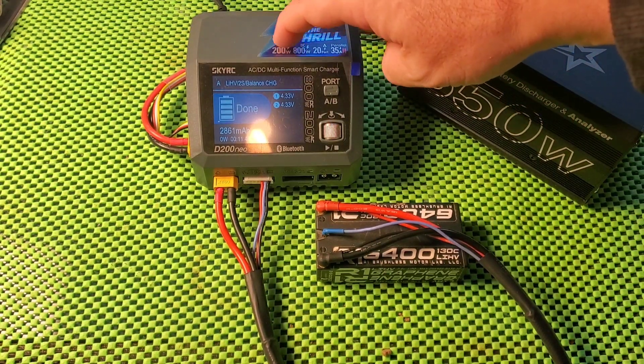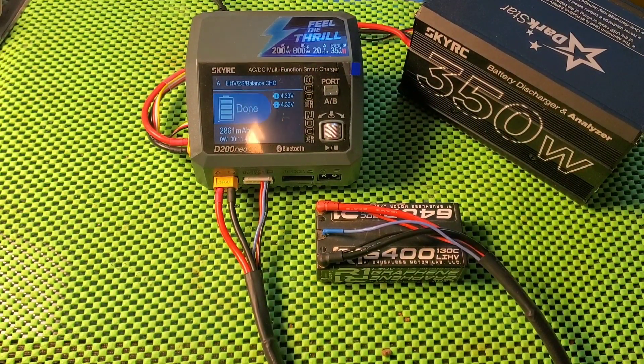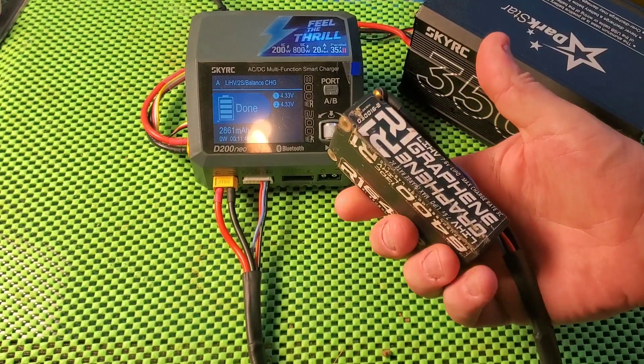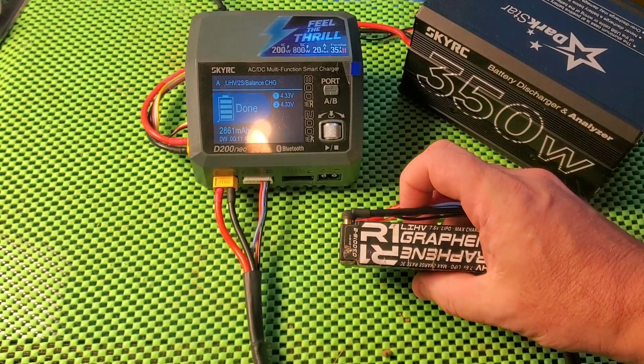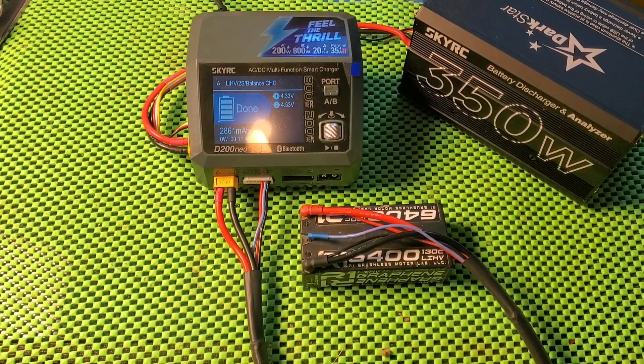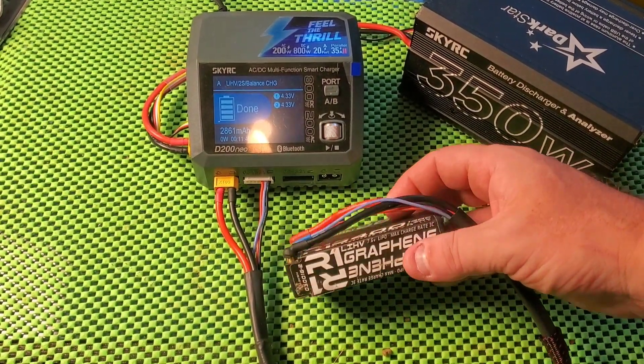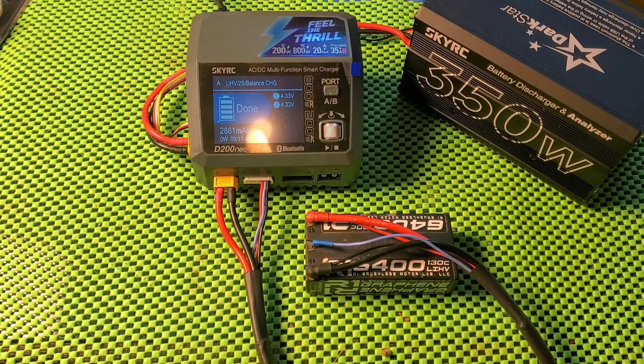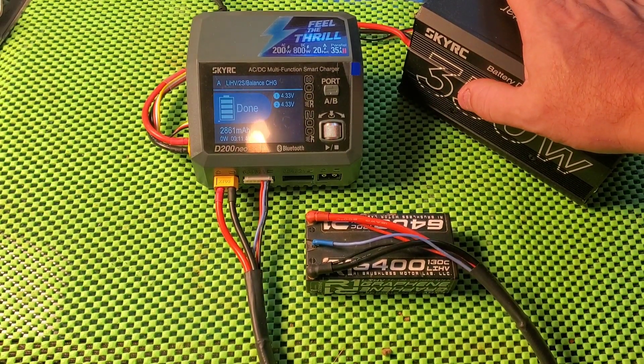So that's what I was noticing — it does bring it close, but it is not exact. You would think that a computer-controlled smart charger could actually charge your battery to its limit. We'll pass this on to SkyRC and see what they do. Maybe there's a firmware update needed. Maybe it doesn't like my battery — this is a high-capacity, high-quality battery — so maybe they tested it with very low milliamp-hour or softer batteries, I'm not sure. But it definitely shows it's at 4.33 and it cut off at 4.35. Thanks for watching.